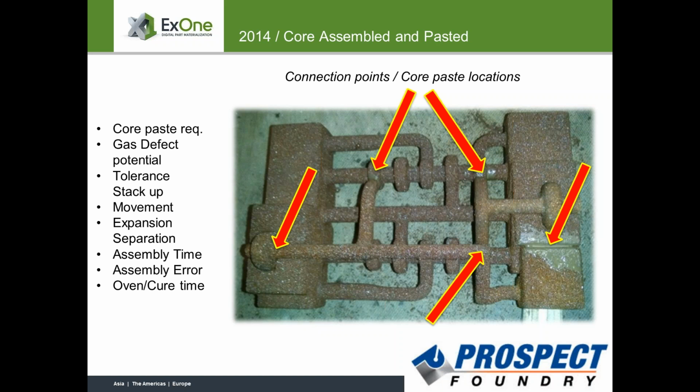And right. Where one might make a perfect core, the next one might make a just about perfect core, but the measurement of how much they were off is almost indiscernible by the eye. You'd have to measure it with a micrometer to see. So there was some variation there, and that's normal. No matter how well the core box and pattern are made, you're going to have some variation.